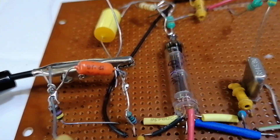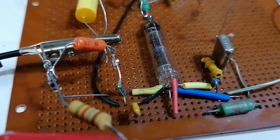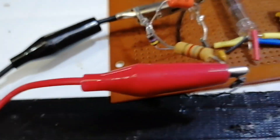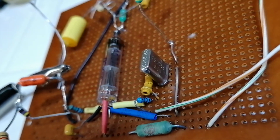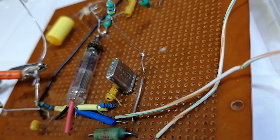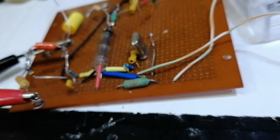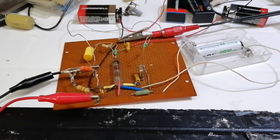The crystal I'm using is a 45.033 MHz crystal. It says something different on the top — one four five point something — but this is obviously for some amateur radio receiver or transmitter. It does have the frequency on the side: 45.0333 MHz. So it's not that far off the 45 MHz we should have for channel one — that's fine.